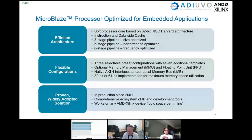The MicroBlaze architecture's white blocks are enabled by default for both the microcontroller and real-time presets, while the blue blocks are for the application processor. Customers have flexibility to select any building blocks for their application, allowing excellent customization. MicroBlaze supports three pipeline stages, five stages, or an eight-stage pipeline depending on whether you optimize for area, performance, or frequency. It also supports a memory management unit, floating point unit, and AXI4 interface.